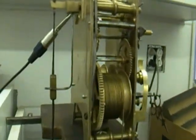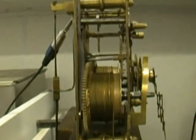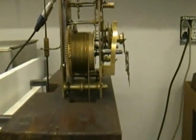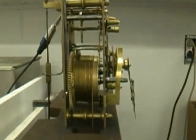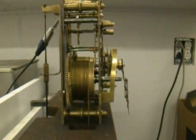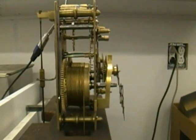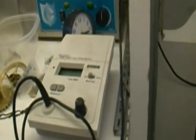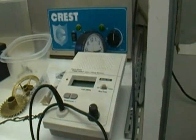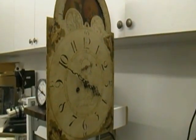Now on the test bench, I put the pendulum on and went ahead and checked the beat. It was off — in the level state it was off by 400 points according to the time tracks, which means it was really out of beat. It would sound like tick-tock, tick-tock unevenly, instead of a nice even tick-tock. Having one of these time tracks really helps. Let me show you what it sounds like — nice and even. Another clock brought back to life.